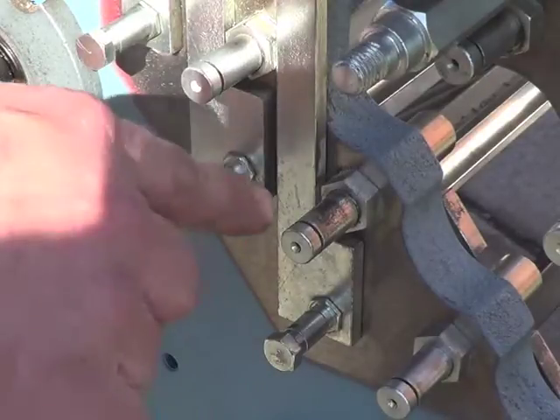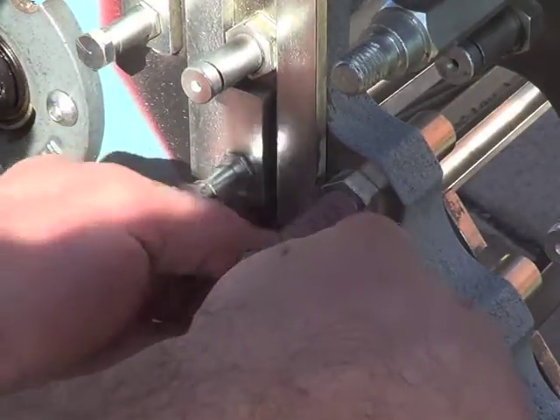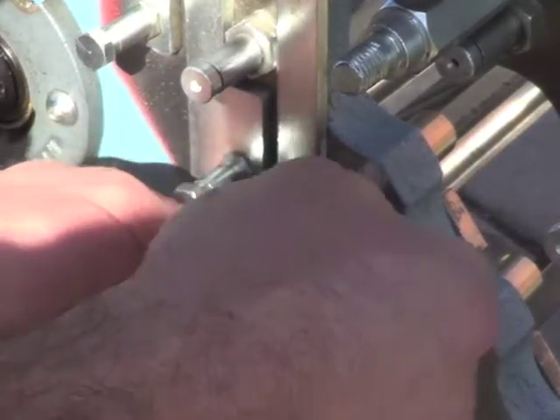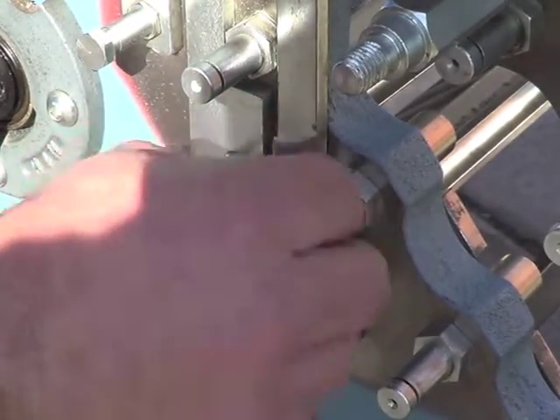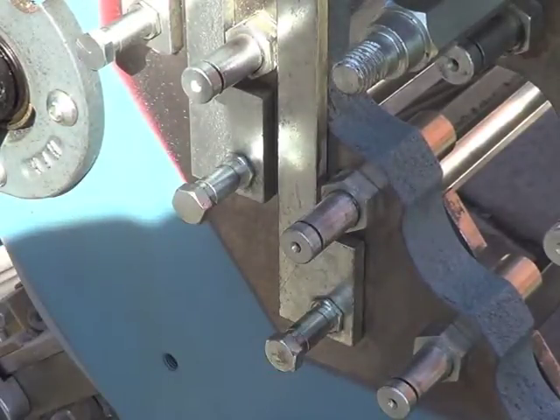The post also has a mar mark on it and it's not smooth. We are now using emery cloth — a 300-grit emery cloth — to smooth that off. And always remember to put grease on those when you put your adjustment arm back in service.